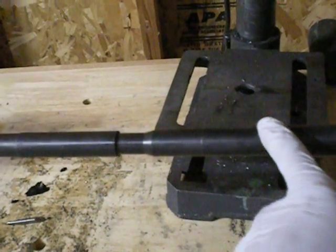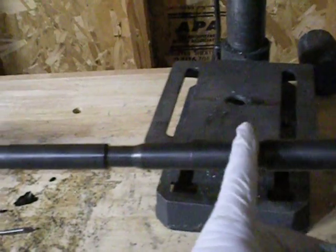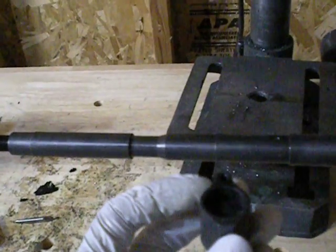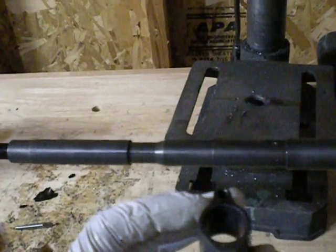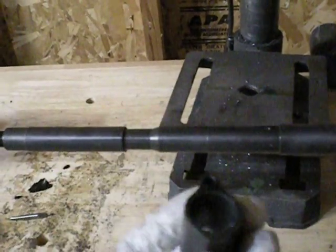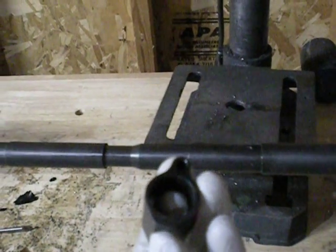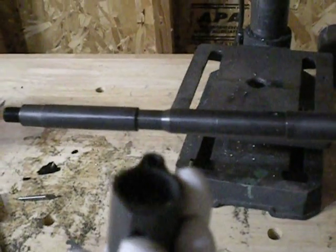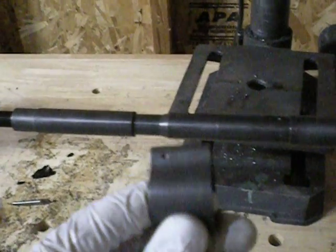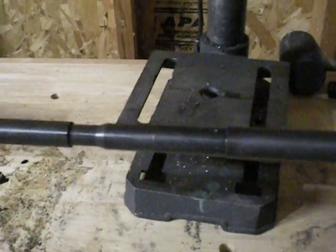In case you do over-gas it — if you find that 78 thousandths is too big, or if you like to go out to the outer tolerance and adjust back in accordingly — that can be done just with the gas block. Essentially, you drill through the gas port almost immediately across it, just on one side, not all the way through. Then use a bottoming tap to tap for a set screw inside there. As you thread it in and out, it will block the gas port and you can control how much gas actually flows through — even turning it completely off if you're using a suppressor. It's a little more tedious than some of the nicer ones out there, but it's a hell of a lot cheaper. About twenty-two bucks plus about twelve cents for a set screw and you'll have an adjustable gas block.